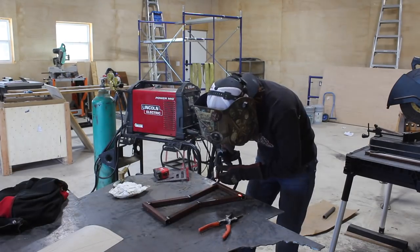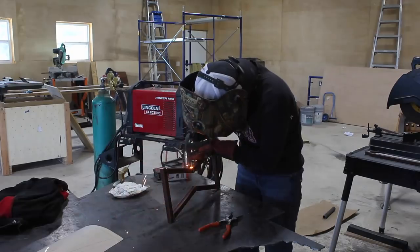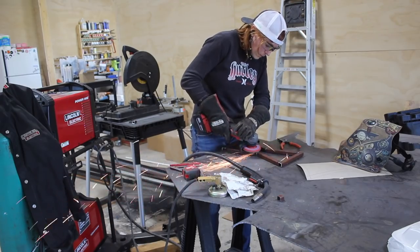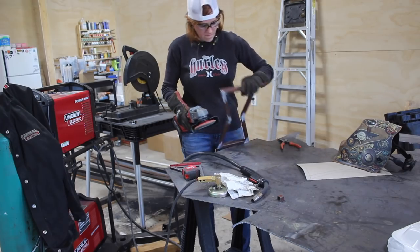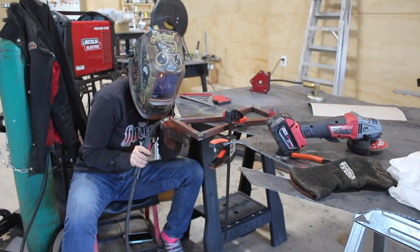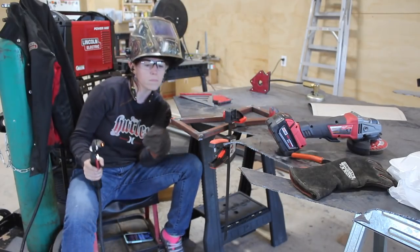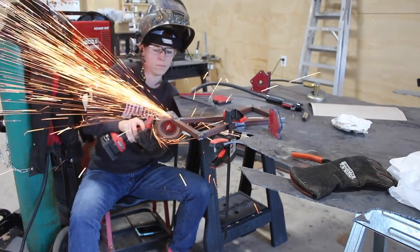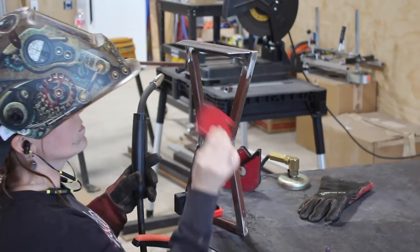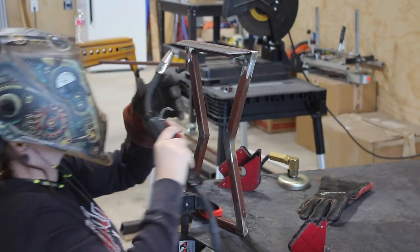After getting all six pieces cut I first tacked them together and then welded each joint closed - not really for strength but so that the leg could be painted without showing open joints. I wanted it nice and smooth so I grabbed a grinder and ground down each seam until it looked like the bowtie was made from one solid piece of metal. A tip: if the top and bottom horizontal pieces sit on top of the vertical pieces you'll need to cut caps for the ends, but if you orient the vertical pieces to extend past the top and bottom you can avoid that step. The last welding step was mitering some thin flat stock and tacking it in place to create a wider footprint on the underside of the table.